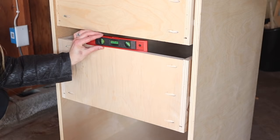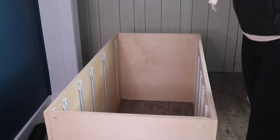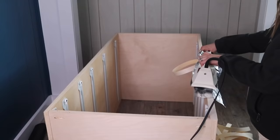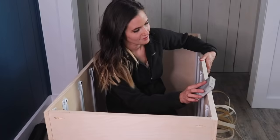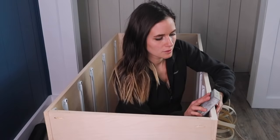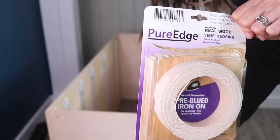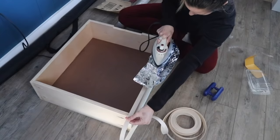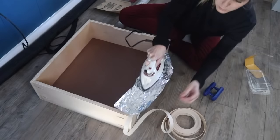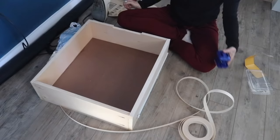Once I finally had all of my drawers built and mounted and level, it was time to bring my workpiece inside and continue improving the closet. The box got edge banding on the front — when the drawer opens, some of this area will be visible and I didn't want the edge of the plywood with all those lines showing. I got this off Amazon — it's iron-on pre-glued edge banding in birch so it matches perfectly. This is my first time ever using edge banding, and this project gave me a lot of experience with it because I covered the top of every drawer, all the edges of the drawer fronts, and the front of the box. I think I used 35 or 40-ish feet of edge banding.